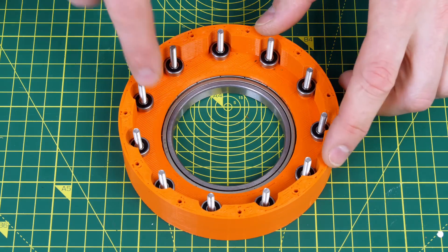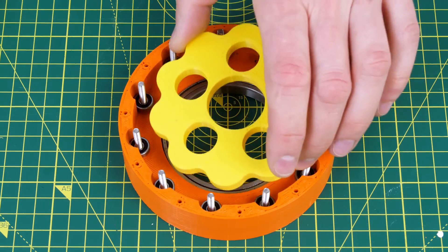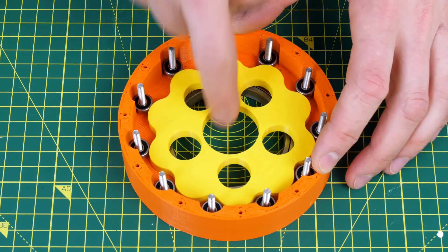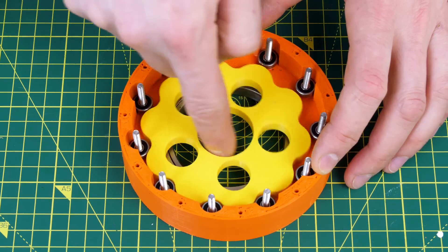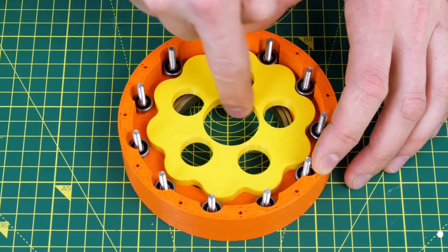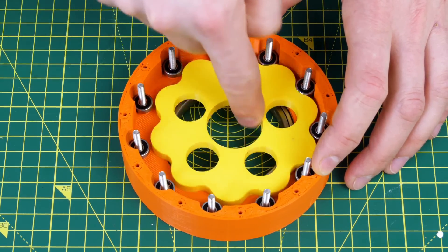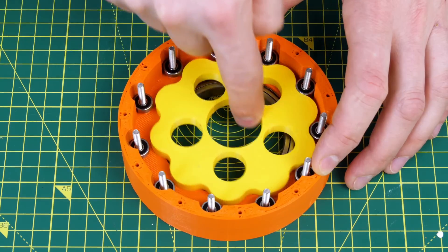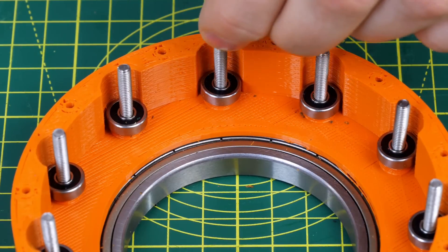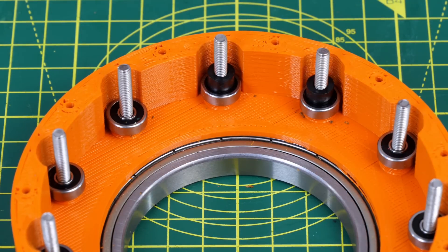As with the first version, the main body for my cycloidal reduction has a bunch of bearings around the outside that the cycloidal disc can run on. Each one only turns a tenth of a turn each time that cycloidal disc comes round, so they're not going round fast — it just saves plastic grinding on plastic, which is where some cycloidal gear reductions tend to fail. I've got spacers which fit on top so we can put another layer of bearings on for the next cycloidal disc.